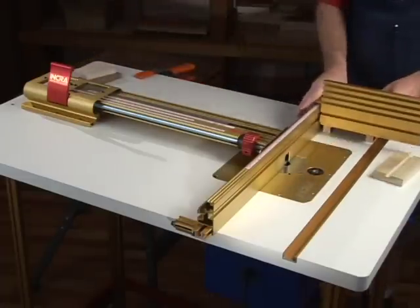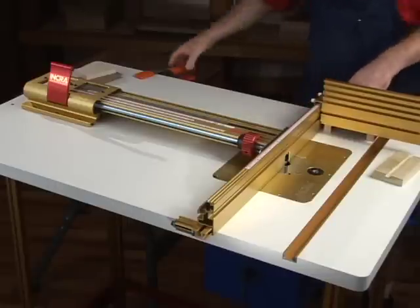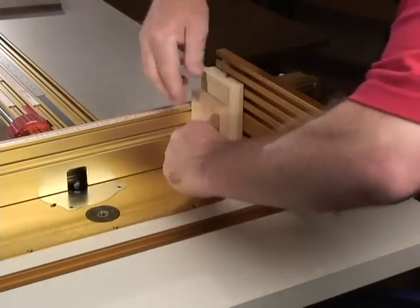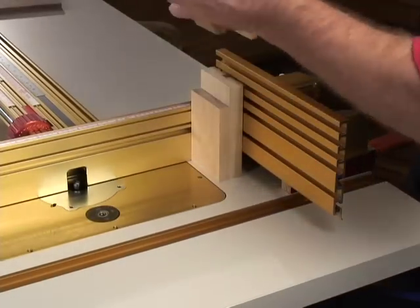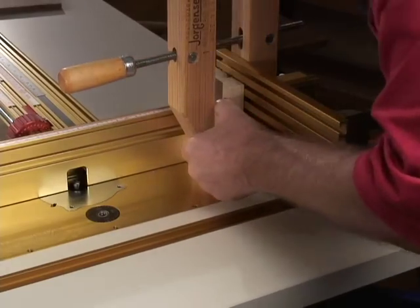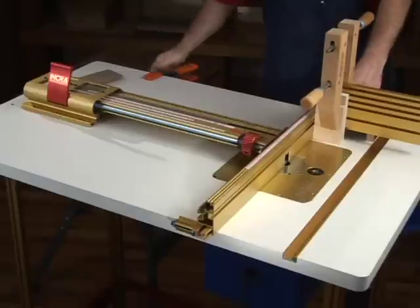Clamp the right angle fixture to the fence and table, then clamp the two shorter pieces of stock with a backing board to the faceplate. You can use your centering board as the backing board. Securely tighten the wooden hand screw clamp, then remove the spring clamp.